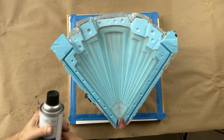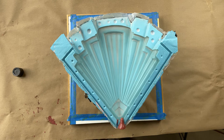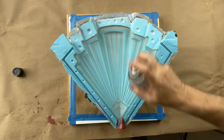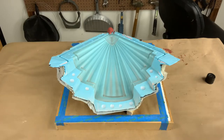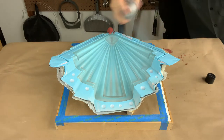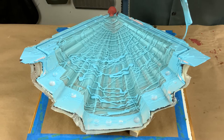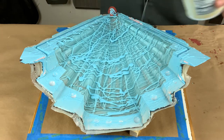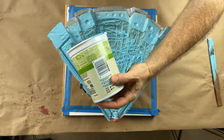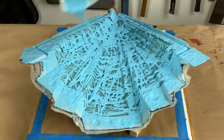We really don't want this second half of the rubber mold to stick, so we're going to use parting agent — I'll be fairly liberal around the edges. I'm going to mist the whole thing so it has an even coat. I mixed up some rubber — this is the coat that's going to reproduce the surface of this glass. You might ask if I de-aired the rubber in the vacuum chamber before I put it out, and the answer is no. When you sprinkle rubber around like this it's such a thin film that the bubbles rise right to the top — it de-airs itself. By the time this rubber cures, all the air bubbles will have risen out.